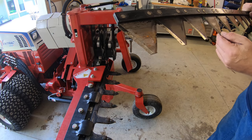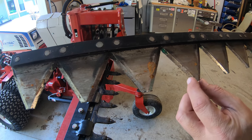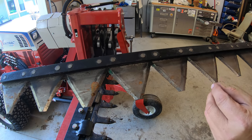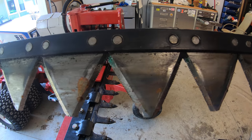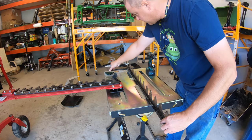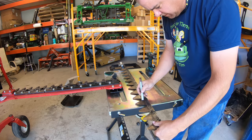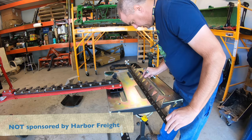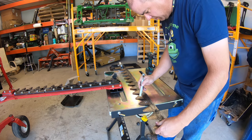We now have the knife in hand. I'll give you some up close views of those sections. That one I believe is the one I hit the steel post with—that one's a little damaged. Overall these are in pretty good shape. I have three replacement sections on hand, so I have to choose the three worst sections. I'll use this little soapstone—Harbor Freight soapstone—to identify the worst three. Those two are definitely bad, and that one's probably the worst remaining one.